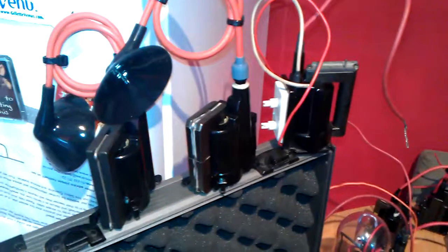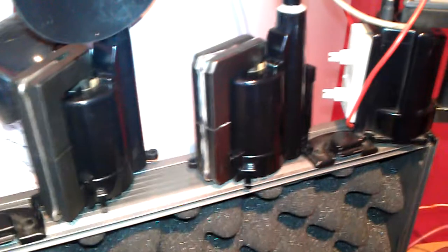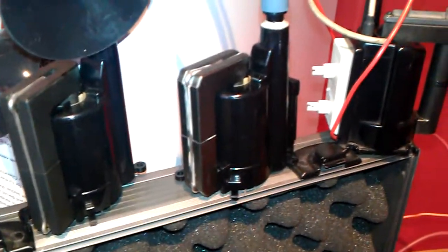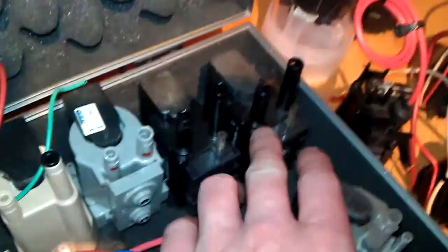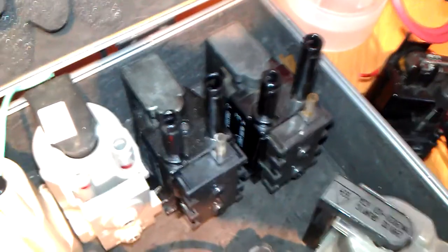These are some of my favourite ones which I will not use for ZVS or for the 555 timer. These ones here are two of the same — 50kV wire on them. I've tested them with my ZVS but only at about 12 volts, just give them a quick test. And these ones here are two of the same — found at the scrapyard, as they were inside some boards that I found. They weren't in the TV or monitor — they were just boards lying around.